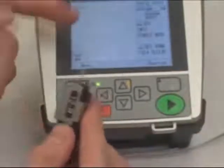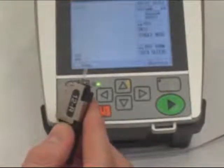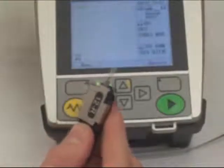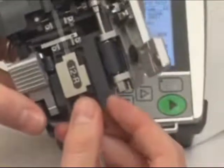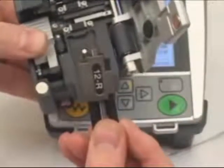You can then with your finger flip the fibers gently to make sure that none are sticking together. Next, take the holder and drop it into the S325 single-action cleaver. Close the lid and then push the button, perfectly cleaving all fibers simultaneously. The remaining fiber scraps are pushed into the waste bin at the left end of the cleaver.